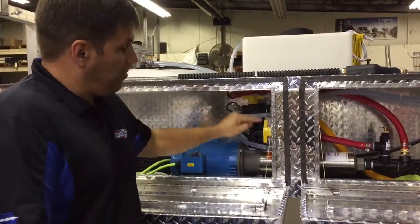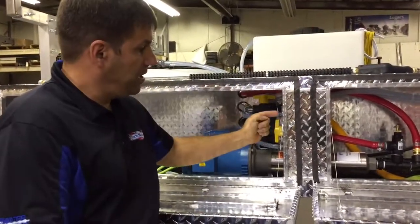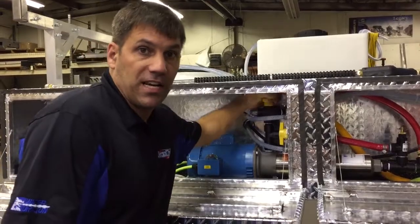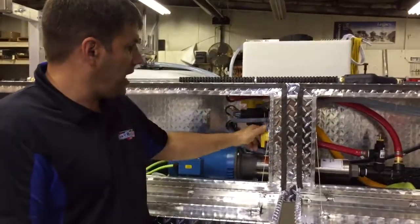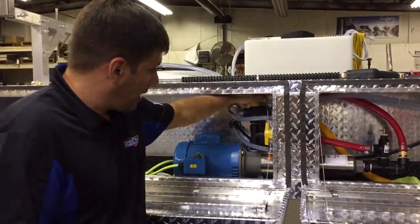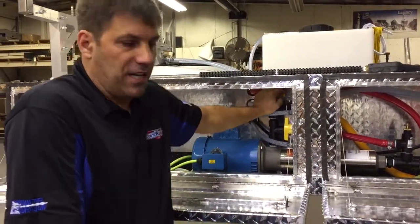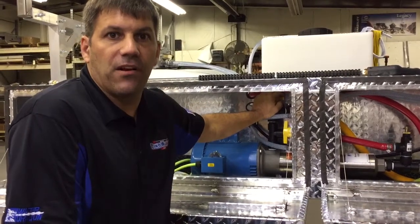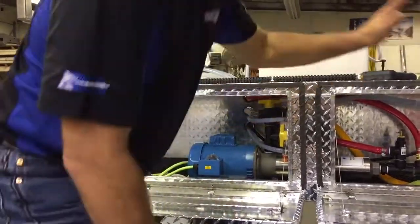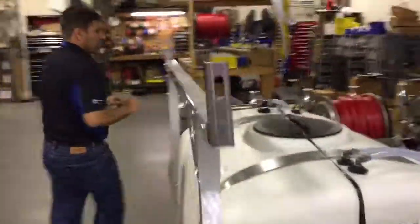Once it's primed, we're going to come back over to this selector valve, which controls the SH valve on the proportioner, so you're drawing from either SH or water. We're going to turn this one back down to water and do the same process again. So now all our lines are primed. Once all our lines are primed, we're going to turn this valve back to the SH. What I like to do is just turn this to the direct feed, squeeze the trigger, and get all the air out of the line so you're ready to spray. Then turn it back to the proportioner so we're ready to start going, and now we're drawing from the proportioner.